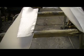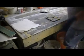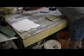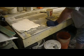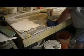Back when I first started making parts, I believe it was on the nacelles, this old boy told me he was having trouble with the primer still shrinking after he pulled out his parts — he was able to see a lot of his glass weave. I think it was because he's using lacquer primer. That lacquer primer is the shrinkingest stuff I've ever seen, and this urethane doesn't seem to shrink as much as that lacquer does.